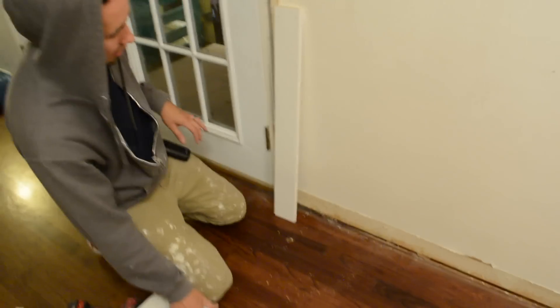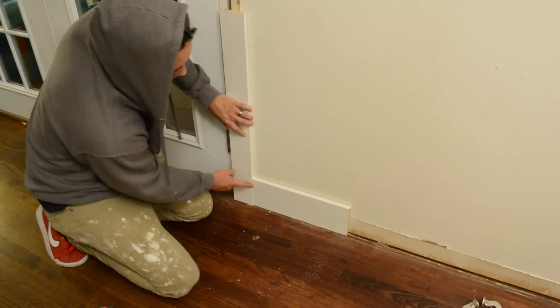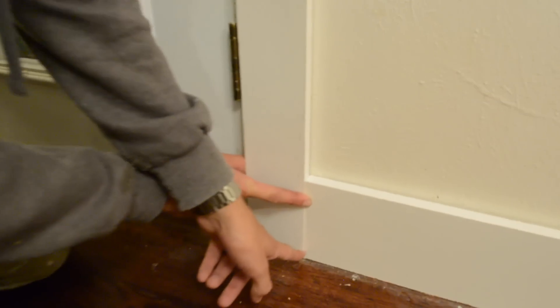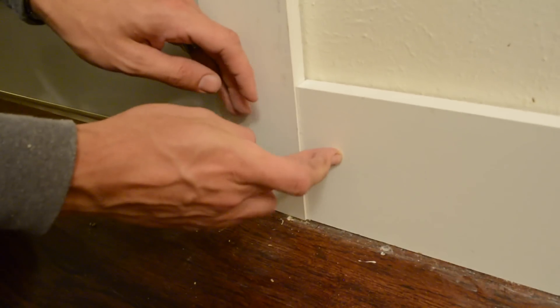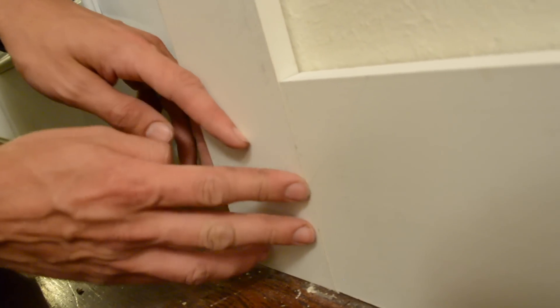The reason I do that is because I don't like messing around. These things almost never line up straight — you always have to shim it out and do some weird stuff. I don't like how you can feel that ridge. So when I put these together with pocket holes, they should be really flush.